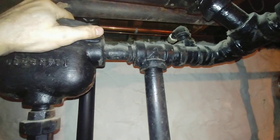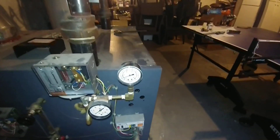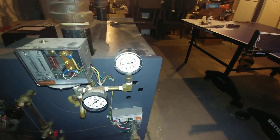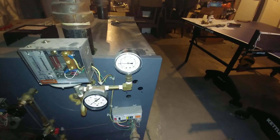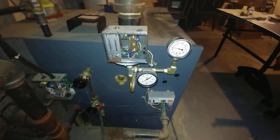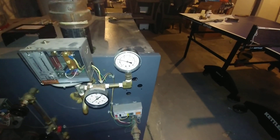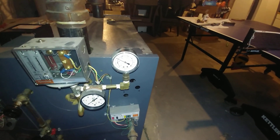There's the pressure, and if I put my finger in the hole, watch the pressure increase as the steam is sent into the system, pushing the air out ahead of it. Since the air can't get out of the way of the steam, it just compresses against the steam and the boiler continues to add steam to the system, raising the pressure.